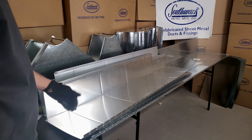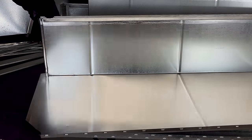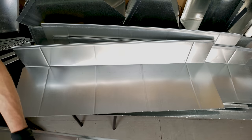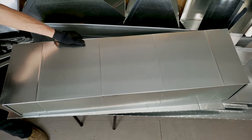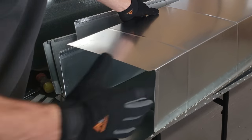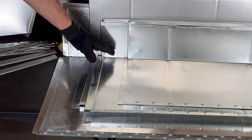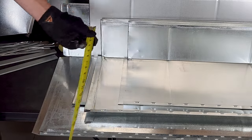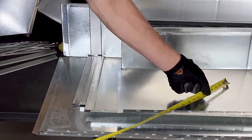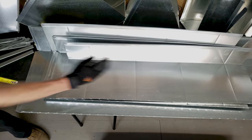When you order a four-foot section of ductwork, or even an eight-foot section, they're going to come in two pieces and have to get hammered together with a mallet or a duct hammer. This little ridge goes right into this section in order to lock the two sections of ductwork together. We have different widths and different rail sizes, so you want to make sure you're ordering properly. In this case, it's 12-inch by a six-inch rail size, and that's a four-foot length.